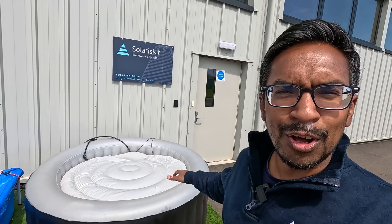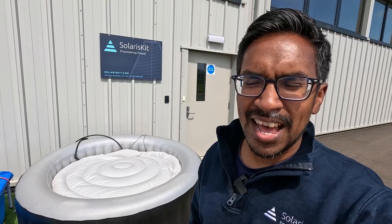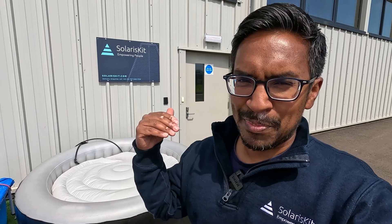We've found that with these solar collectors we can heat a hot tub all the way to 37 to 38 degrees Celsius, but of course you need sunlight to do that. Alternatively, you can use the solar collectors to heat the hot tub as much as possible — any heat from the solar collectors saves money and lowers greenhouse gas emissions — and then just top it up with a backup heat source.